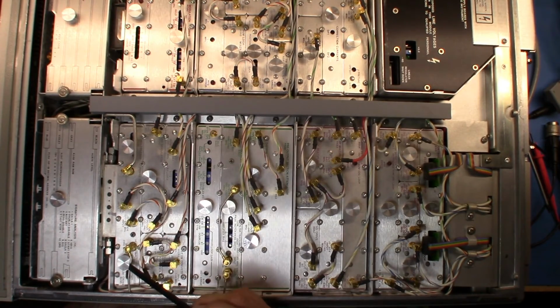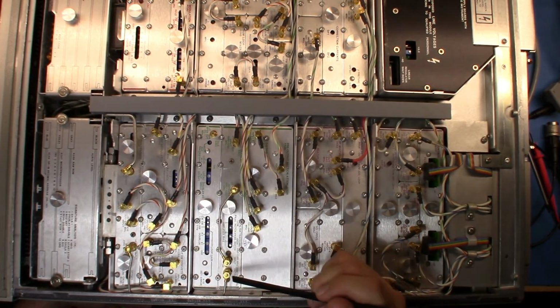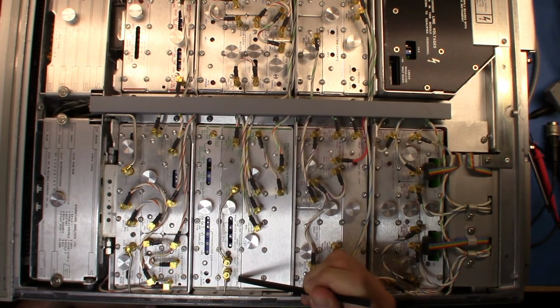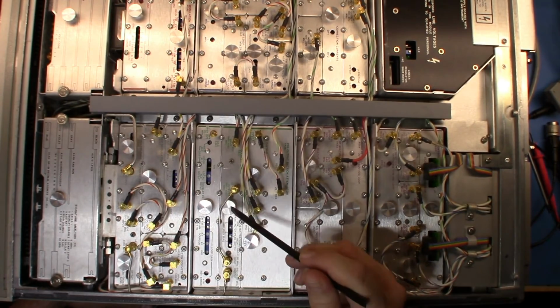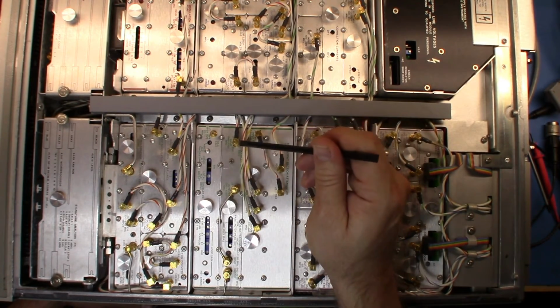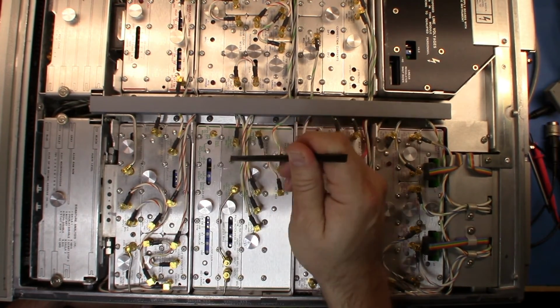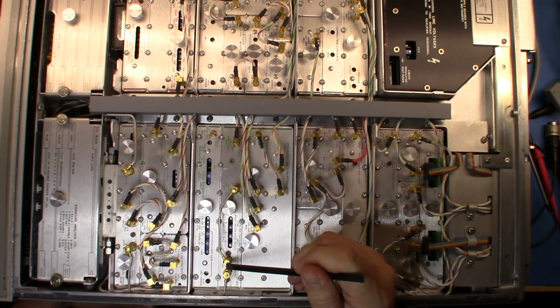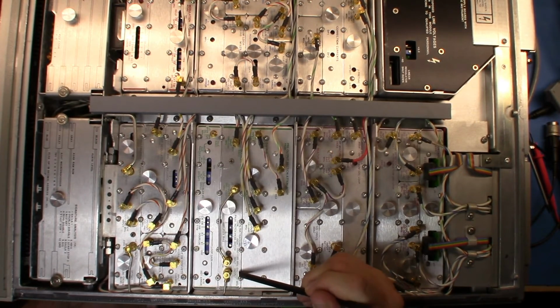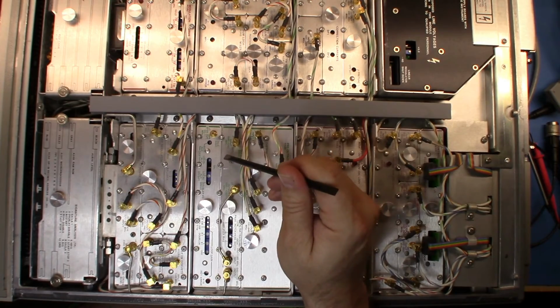Now the 640 to 2560 megahertz is coming via this little hard line that is served by this unit here. And you can see here that this does the output to 640 to 2560. And what it's actually doing is getting an input here that's 640 to 1280, and then it's doubling this. So this is 640 to 1280 coming into here, and then it's coming out of here doubled to 640 to 2560. So that's giving us our double range from basically the 640 to 1280 input.